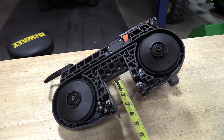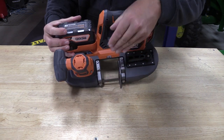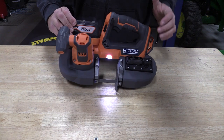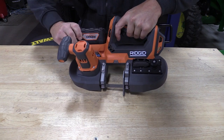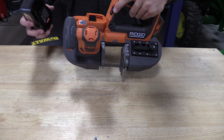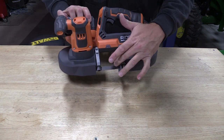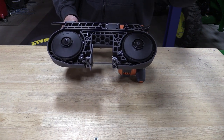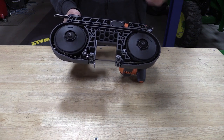You have a two and a half inch width capacity but a three inch cut depth. If you are cutting with the saw down and it's a very narrow piece, you actually have more depth than that as it'll slide right in between this area. The LED light comes on with the trigger, and you also have a variable speed adjustment — somewhat hidden by the battery — that goes from six infinitely down to one, giving you a blade speed of 320 to 680 surface feet per minute. The blade size is 32 and 7/8 by one half inch by 0.020 inches, a very common blade size. I'll put links to more in the description as this only comes with one 18 TPI blade. You do have an adjustable work stop.